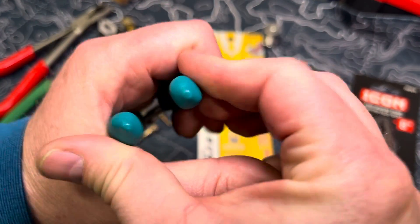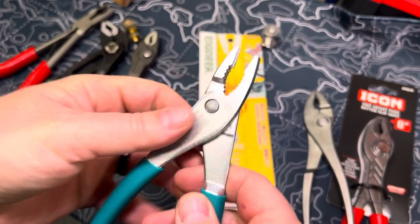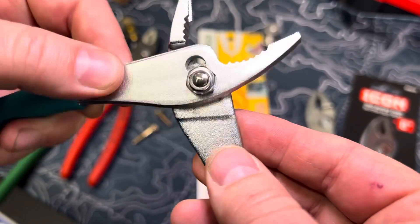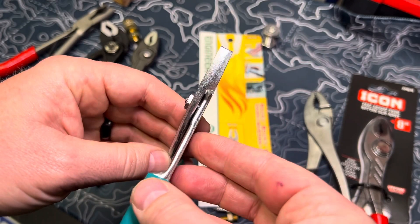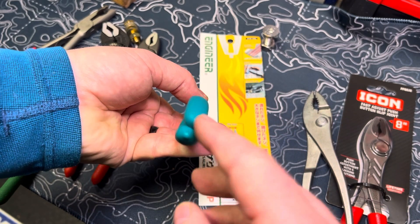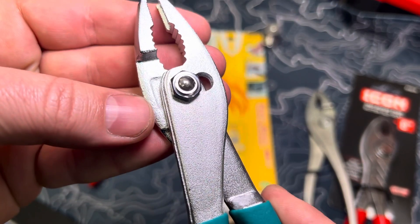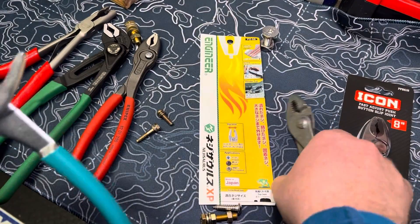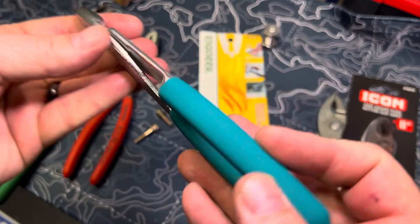Arm deflection — as you squeeze tightly — is very minimal. These are very solid. The slip joint is actually an adjustable nut, so you can over time adjust and tighten it back up as needed, to make sure they stay nice and tight. Out of the box they're just a little bit loose — I'm going to probably tighten them up just a little bit. Straightness-wise, it might be off just a tad bit, but overall the finish on the jaws looks pretty good. No cutters on the inside — sometimes these obviously won't have cutters. These ones are specifically going to be used for bolt extracting.